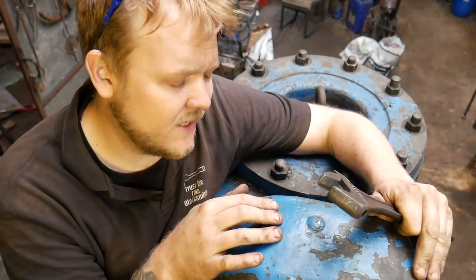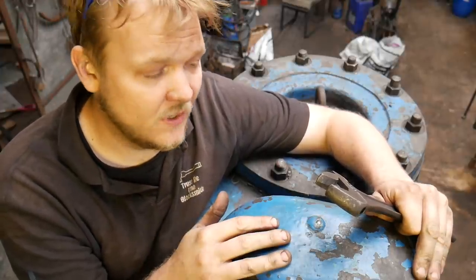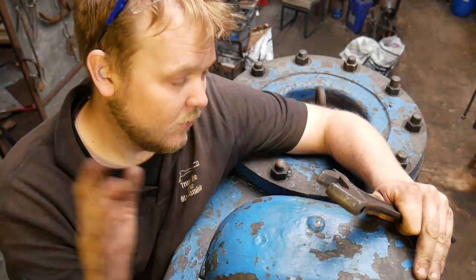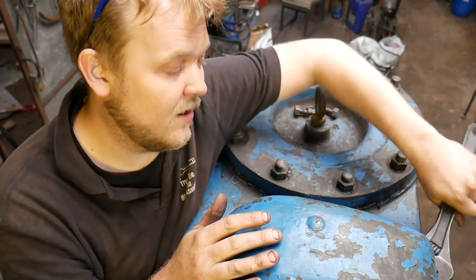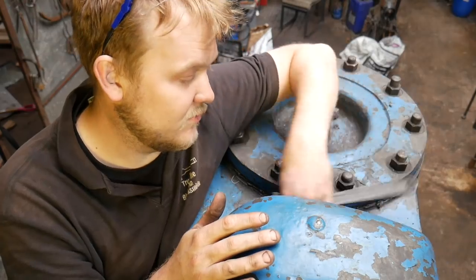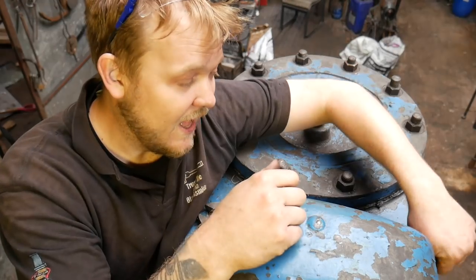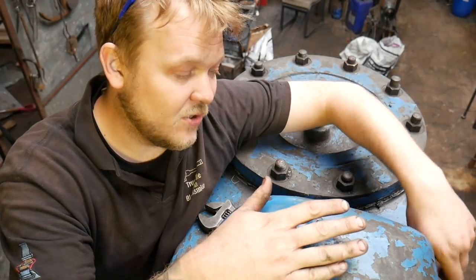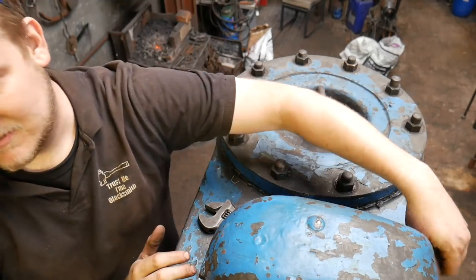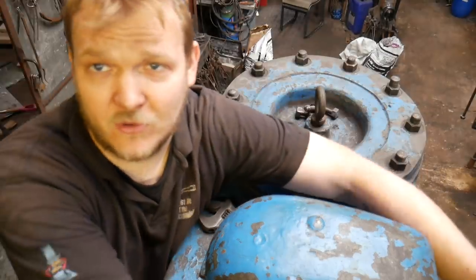I've been running the hammer now for a couple of weeks, and we did some adjustments to the valve timing, which we're going to redo. Valve timing, valve adjustments, valve setting, I don't know the right word. Anyway, we're going to do some more adjustments to it. I'm going to show you this bit. I've already done it, but I turned the camera on after I'd taken it apart, which was stupid. So you basically filmed the top of this power hammer whilst I was taking everything off. So that was good. We're going to pull the top of the valve out, readjust it to its max up setting, and then see how we get on. Last time we adjusted it, the belts were slipping because someone put the belts on wrong.